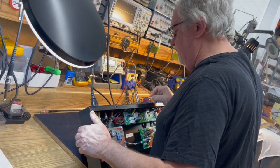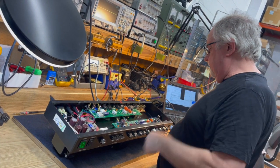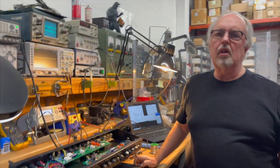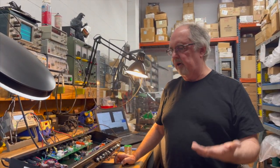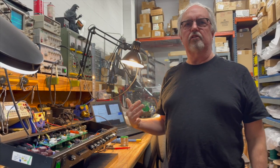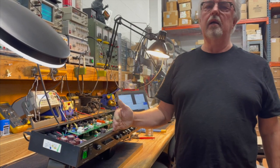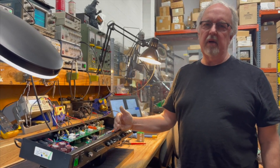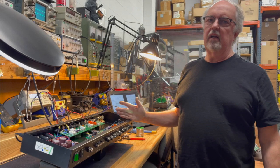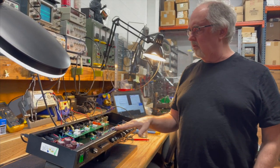it's not that old. I believe the owner, when he purchased it, has already turned it on and played it to check out how it sounds. He's already heard it when he went and bought it. He turned it on and played it to make sure that it was good before he bought it. So within the last 6 months to maybe even 2 weeks, the thing has already been powered up. So any reforming that the capacitors might have undergone by charging it up has already occurred. If it was going to be enough excess current to damage the capacitor, we would see it.